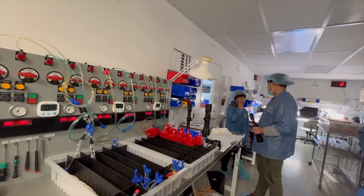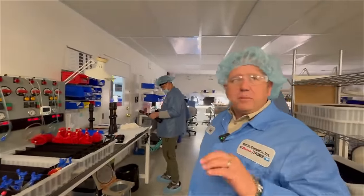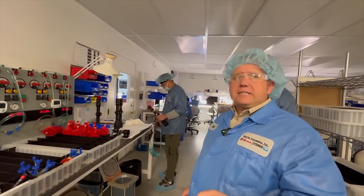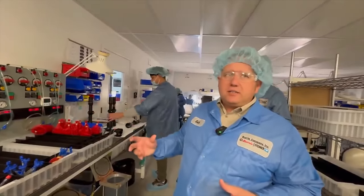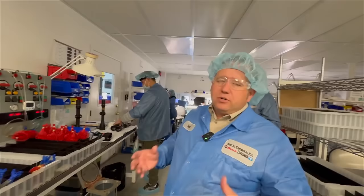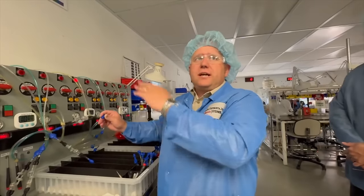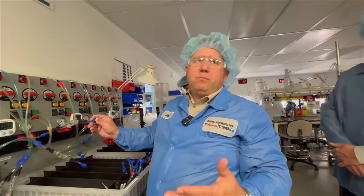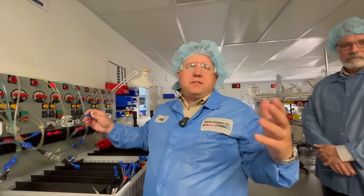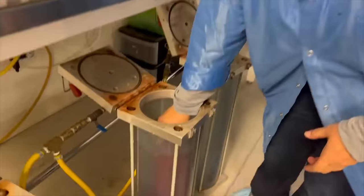On all of our scopes, we usually have one removable screw or one removable component that gives us access to exchange air, or in this case, nitrogen and vacuum, into the scope in order to remove as much of the moisture as we possibly can. That's awesome. We have this go through and cycle numerous times, and we figured out we can exchange about 99% of whatever atmospheric air was in there and replace it with good, clean, dry nitrogen. Cool.